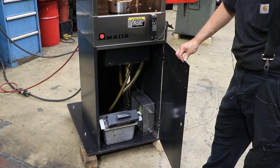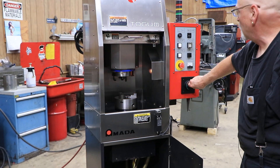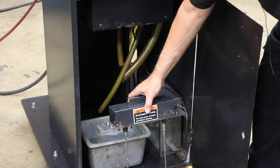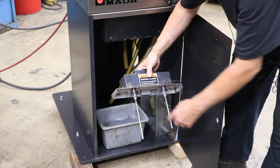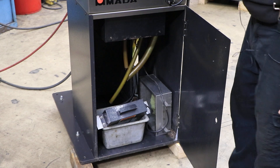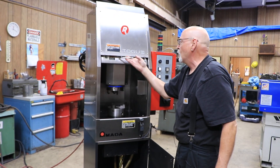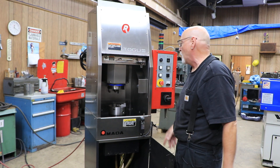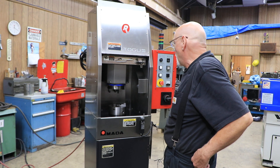I don't have the tank in here right now because I don't have it full of water. But this machine has a sensor that would go into your coolant tank. The tank is much bigger and fits right inside there — we'll have photographs of it. These two probes go into the water to let the machine know it actually has coolant, because when it goes on and you close the door, it blasts a lot of coolant around. There are three coolant lines mounted below the spindle shooting coolant all over the place, so it won't run without the coolant.